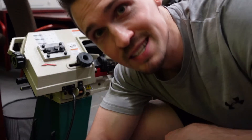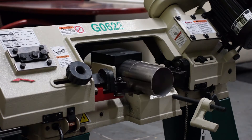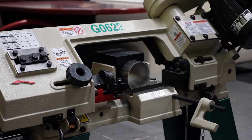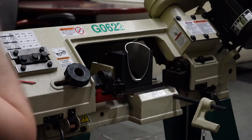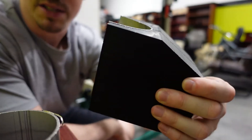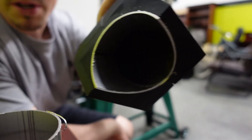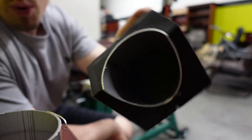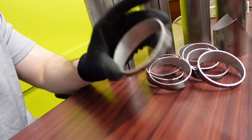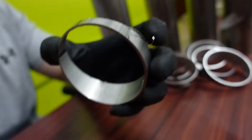When I'm talking about having a nice cut, I mean something like this. This is why jigs are super important — they really hold that tube in place while the bandsaw cuts it, giving super clean cuts, which is exactly what we need to make that Y-pipe. Now that we've spent the last two hours cutting all of our material, we're going to have to clean it up. If you take a look at these pie cuts, they've got these little bits of metal called burrs — little rough edges that are going to get in the way of tacking it together.